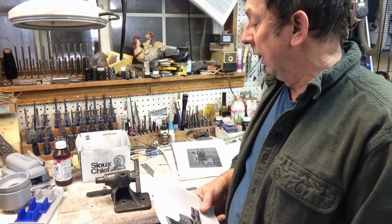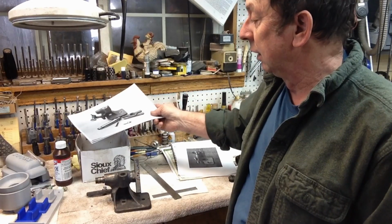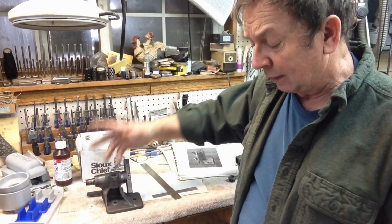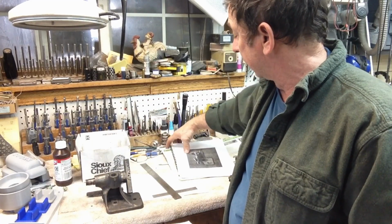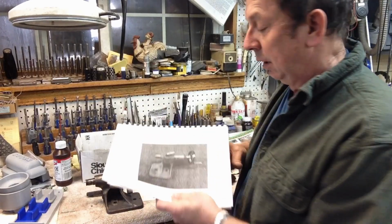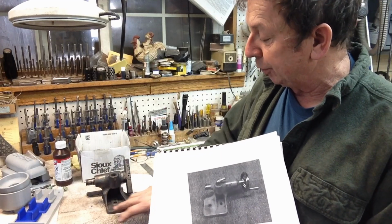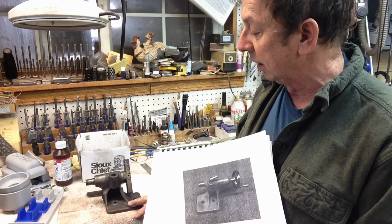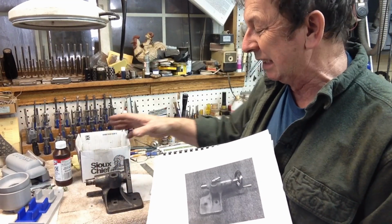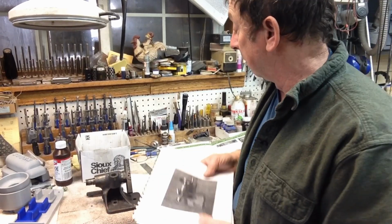And so the first thing we're going to do is develop a tailstock pattern for this. I'll just give you a little bit of my thought process in how we build these and what we're doing here. I've collected quite a few pictures of the tailstock end, of which here's one of them. It's pretty much a mirror image of this with a shorter base. We've changed our supports just a little bit, and the tailstock tube assembly is a little bit different, but there's a lot of similarities to them since they were machined as a pair.